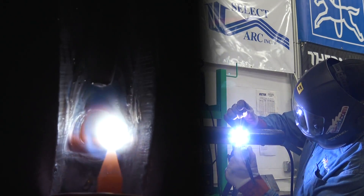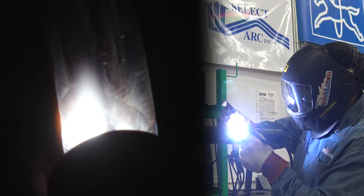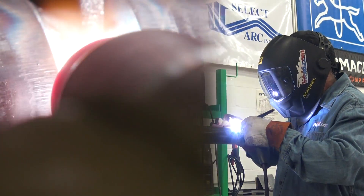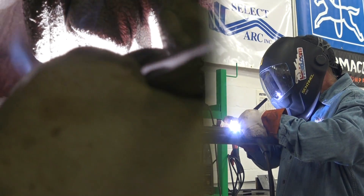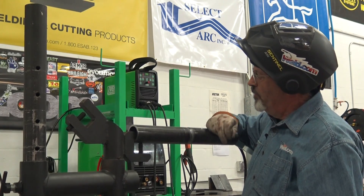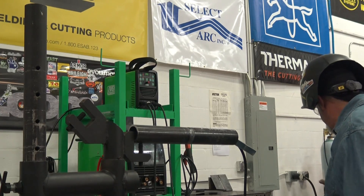So I've restarted my bead. It opened up immediately, so I'm gonna back up a little bit. Introduce the wire. I'm kind of washing this keyhole around to make sure I got a good tie-in on the restart. Coming up on the tack, warming everything up, backing up, adding some wire, and keeping right on going. I welded past where it jumped together to make sure the bead is blended in there. Almost ran out of filler wire — I got about an inch in my fingers. Things were getting a little hot. Another common thing that happens in the field.